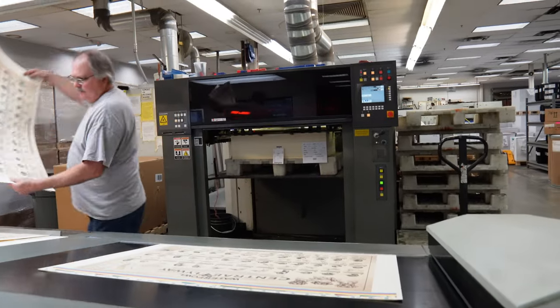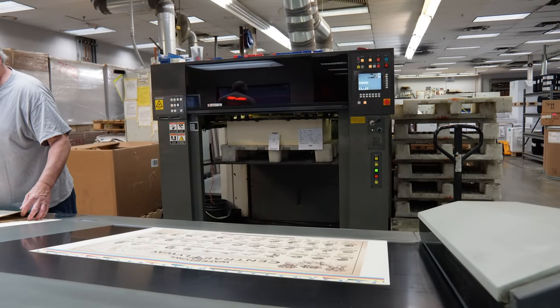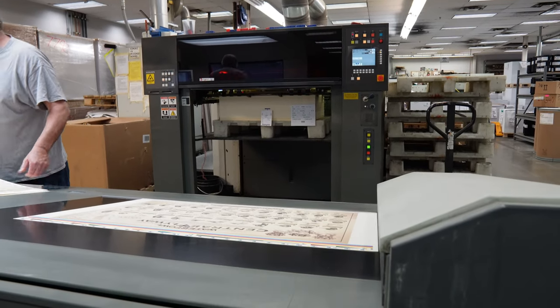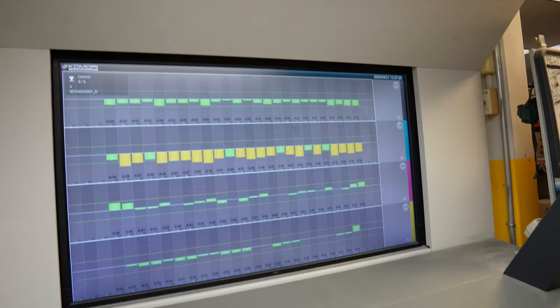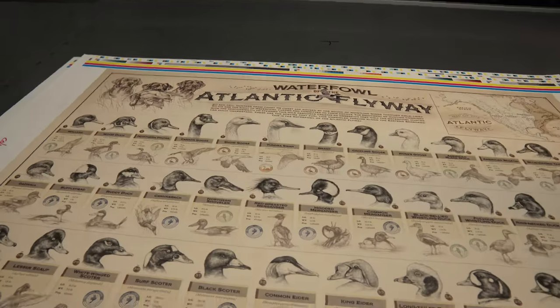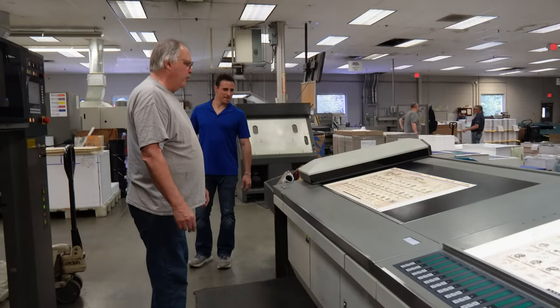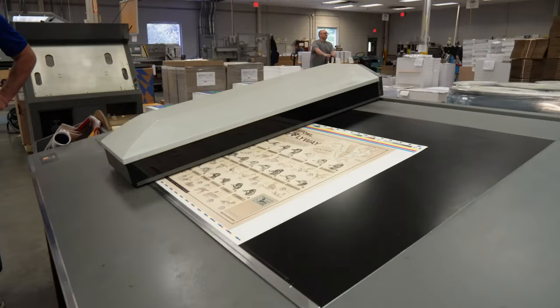Once we get to that point at press, the only thing you can do is shift colors. There's a guy there with a whole system set up — just bring one color up 10%, drop another one 10%, and get that dialed in. Once I approve that, I'll look it over through a little magnifying glass. Once that's approved, they will save that profile in that printer, print the full run, and then save those plates. I think they save them for up to 10 years, so if we ever want to rerun that, they get the plates back out, pull up the profile, get the paper samples we want, and run them again.